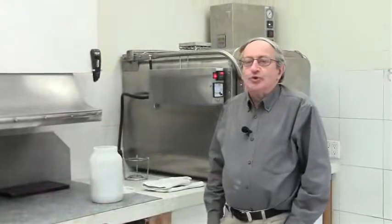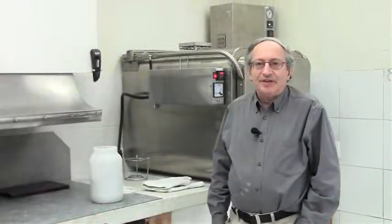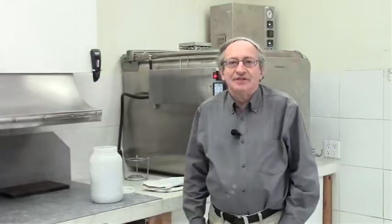So this is just a quick note on how to fix defects before painting. Sometimes you make a sheet metal enclosure and you get some dents in the sheet metal. Especially you get a lot of defects when you have to weld a larger enclosure and you sand off, but you still have some dents left over from the welding you cannot sand out. So the textbook solution is you buy a special high temperature patching compound which can tolerate the baking temperature of the paint, but it doesn't work very well, A, because it's weak, B, because it discolors the paint. And so altogether a much better solution is to use the paint itself to fill defects.